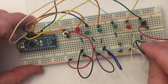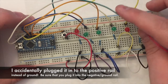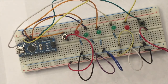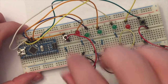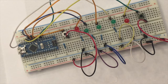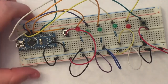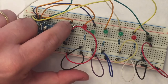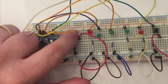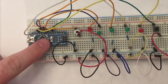When the button is pushed, this resistor still allows a positive voltage to register. We do the same thing on the other button — this is known as a pull-down resistor, and it ensures you always have a valid value coming out of your buttons. We tie that to ground as well. That's the entirety of our circuit building. We had two types of circuits: a current limiting resistor for the LEDs, and a pull-down resistor for the buttons. The rest of the game logic resides on our nano microcontroller.